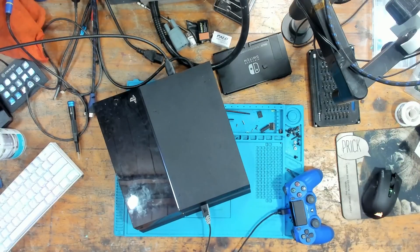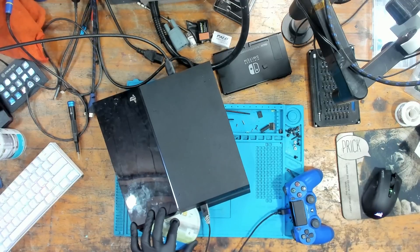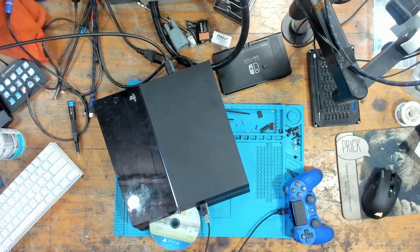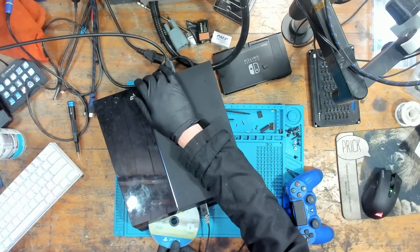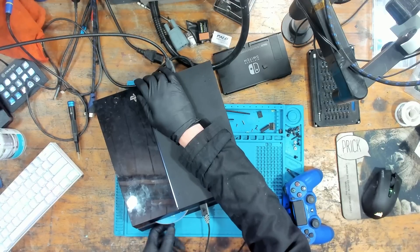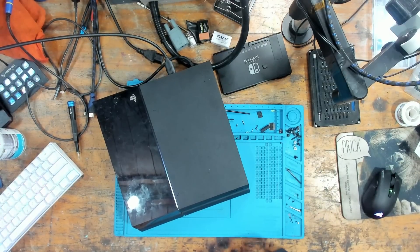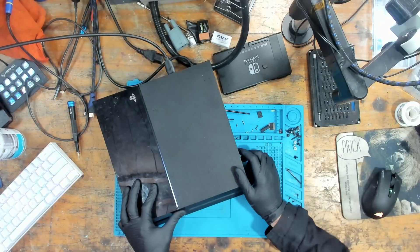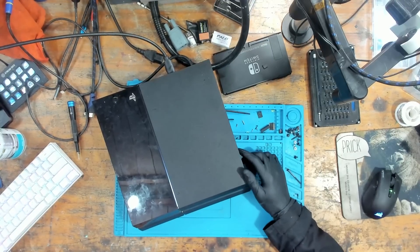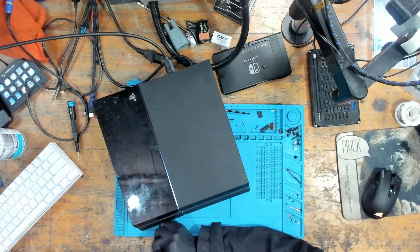Not taking a disk — that's definitely not working. It's resisting like it's got a disk in. Usually you'd be able to push it in freely. That's not taking a disk at all. Let's shut it down. Yeah, I think it's coming in for a disk drive fault. It just says 'logic board fault' on the ticket, and it's on a separate board.